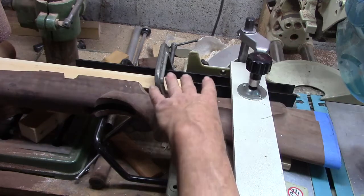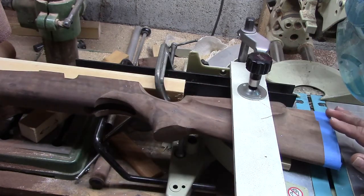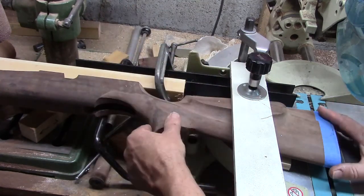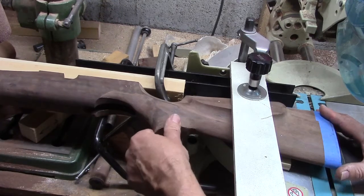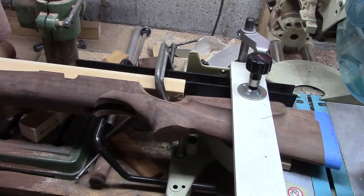And I'm also going to hold it. I'm going to be careful not to put too much force on the wood. As I explained a minute ago, multiple back and forth, very light pressure passes. If I try to bury the saw into the wood, there's going to be torque and twisting, and this is held, but not super securely, so I'm going to go really gentle. I'm going to reposition the camera so I can get in front of the saw, and then we'll make the cut.